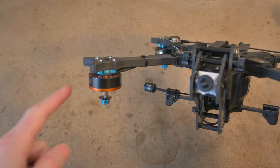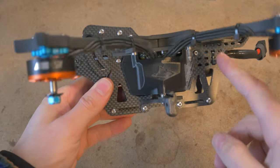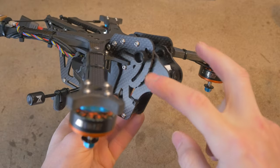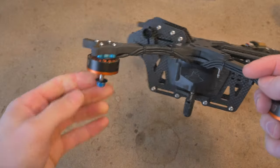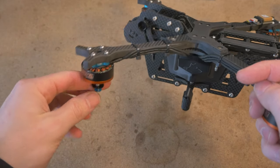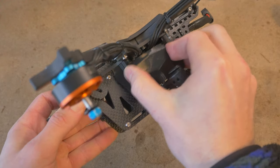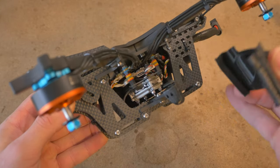An obvious problem with inverted motors is that the propeller is much closer to the ground, and that's why I went for a vertical plate design. This allows for an extra increase in distance without having to use super long standoffs. Vertical carbon plates also work really well with my camera mount design, which I'll talk about later. I also went through the effort of coming up with these easily removable side shrouds in order to protect your stack from debris and reduce the chance of getting short circuits or other issues with your electronics, because running props out instead of in flings grass and dirt directly into your electronics stack.